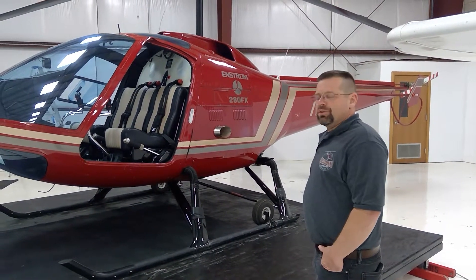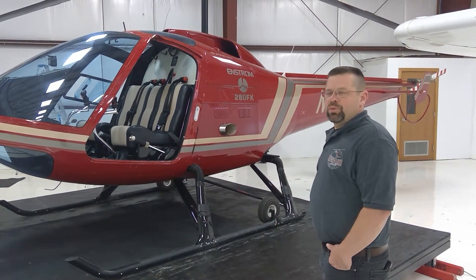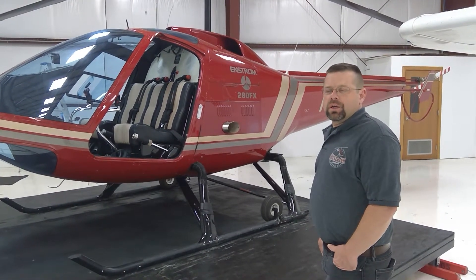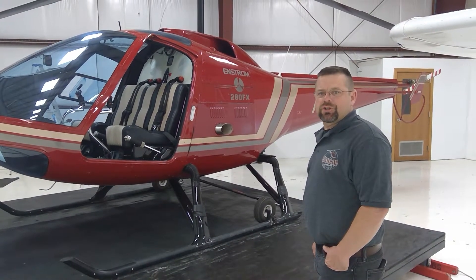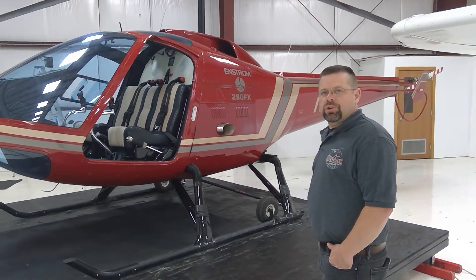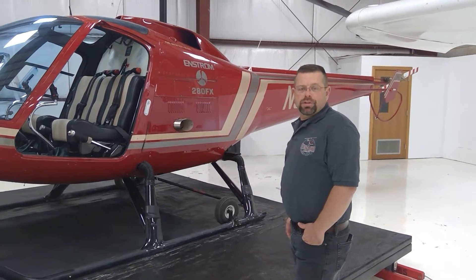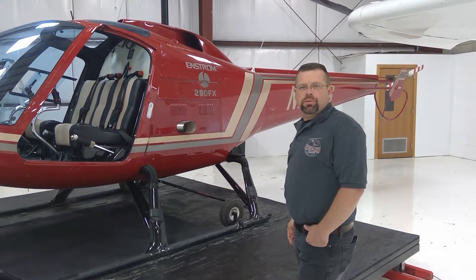It is very important not to have items in the cockpit that are insecure. Things to consider would be your VFR paper chart, even your phone on a suction cup near the open door, the POH, and the Aircraft Airworthiness Certificate and Registration. These things can blow out if you haven't given it some thought on how you're going to secure them. If they blow out of the aircraft, they could easily get caught up in the tail rotor and cause a tail rotor failure.